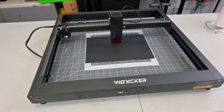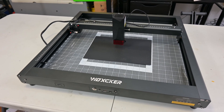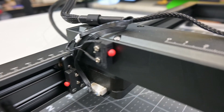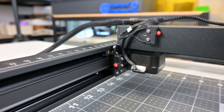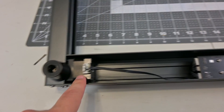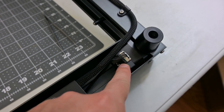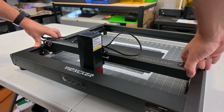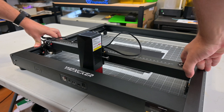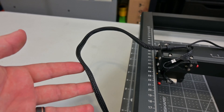The JL7 has a working area of 400mm by 400mm. The frame is made from custom extruded aluminum, and the gantry is belt driven on rubber V-slot wheels. The JL7 is very lightweight and easy to move and carry around. The Y-axis is driven by two independent stepper motors with no coupling between them, which means it's possible to introduce skew. This is generally not going to be an issue if you assemble the frame correctly and don't force one side after homing, but I wanted to point that out.